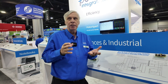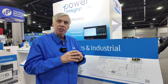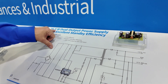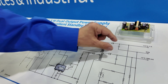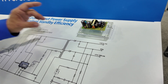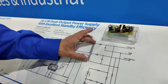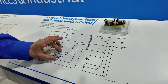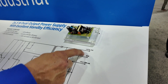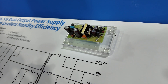The final design we're showing is a TinySwitch for 27 watts, which uses a solution with multiple outputs — a 5-volt and a 12-volt output. The aim is the same input filter, same clamp, flyback transformer, same feedback circuit, and same TinySwitch circuit. The only difference is we actually sample both outputs to get very good accuracy on both circuits in the flyback converter.